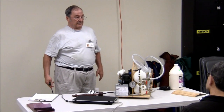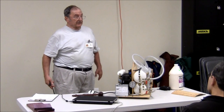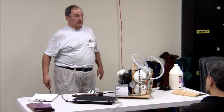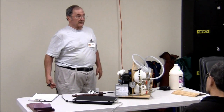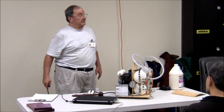So usually 2 to 3 hours is sufficient for a small piece at atmospheric pressure. But when you're doing a large piece under pressure, the glue that's in the center is not going to have the moisture sucked out of it very fast. So that's why you need the additional time. Yes, sir. For somebody who likes to use too much glue too many times.